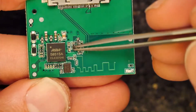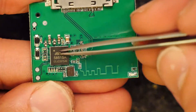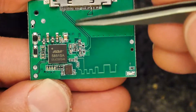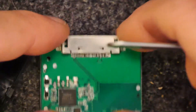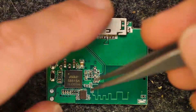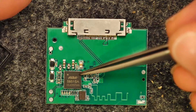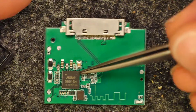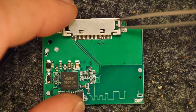These are probably capacitors to decouple the actual audio to the unit, and the rest are just the various resistors and passives that these system-on-chip type chips need. So when you plug this in, this tells you that Bluetooth's ready — it has some CPU in there and a little bit of flash because it can actually produce sound. It tells you that it's connected on Bluetooth using audio through the dock itself.